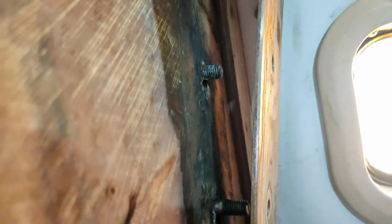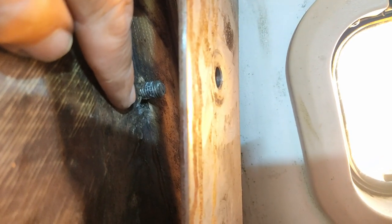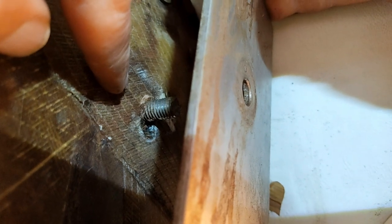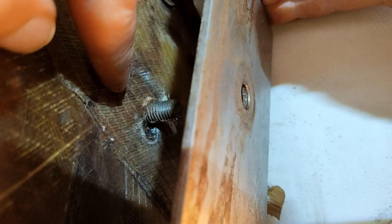You can see there's the bolt and there's where the hole originally started — the bolts have actually chewed up the bulkhead. Looking at the one above, it's nearly a whole bolt hole: that's 10 millimeters that this chain plate has actually moved up since the boat was built. It's only because I sealed the chain plate at the deck with Sikaflex that we've seen the movement. It moved 2mm when we did this trip down to the Canaries, but this has been happening for a very, very long time.